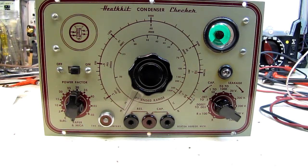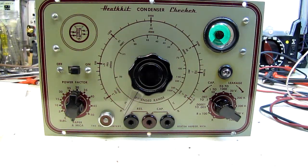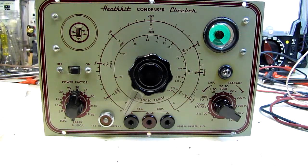What I did was I boosted the voltage on the target. Originally this was running approximately 220 volts on the target — the target being that metal shield with the phosphors on it. I am now running it at a much higher voltage, somewhere in the order of 400 volts DC. And as you can see, it has brightened it up considerably. I know somebody out there is going to say you're bombing the thing a lot harder, the electrons are going to burn through the phosphors, blah blah blah. Well, it wasn't usable before — now I'll probably get a couple more years' use out of it.